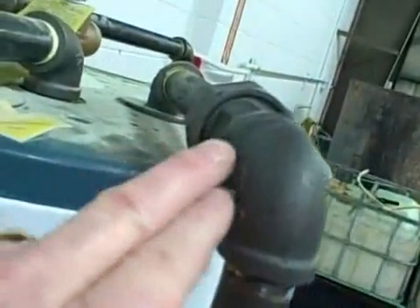Going around the other side here is our processor. You'll notice that the back side of our pre-heat tank — our dewatering tank — there's the pick-up for it. This is where we draw the grease from that tank and put it into the processor. It's about an inch above the bottom of the tank and the tank itself is concave. You can see that much better on the new BD-40 shots on the website. So it gets picked up right here, into the pump, up through the plumbing, and drops into the top of our processor vessel.